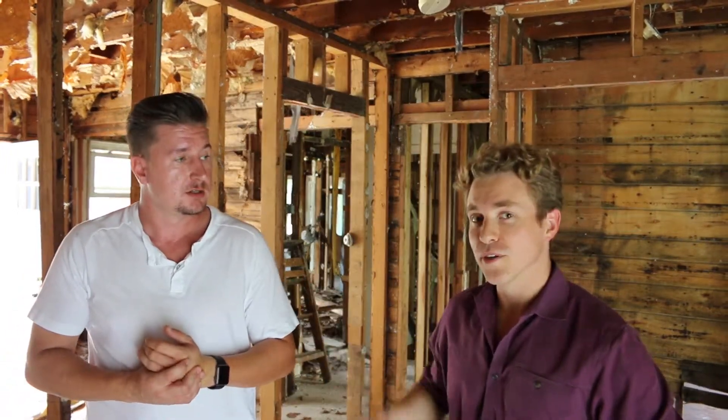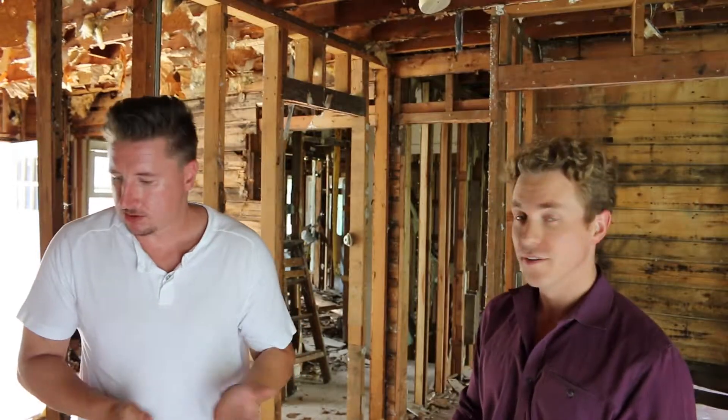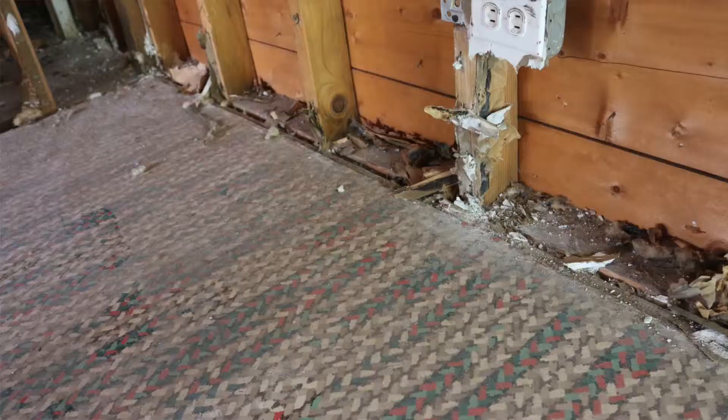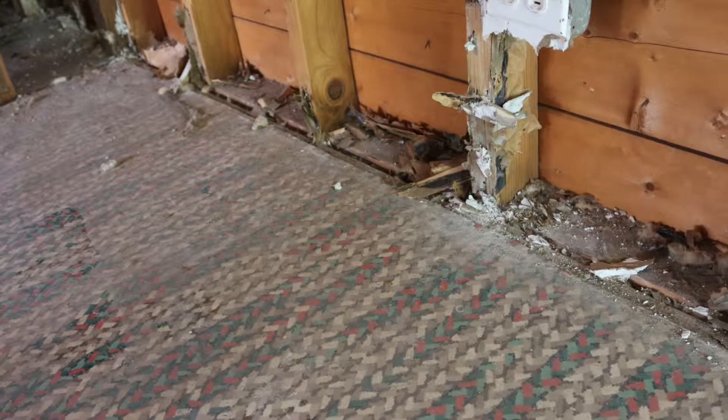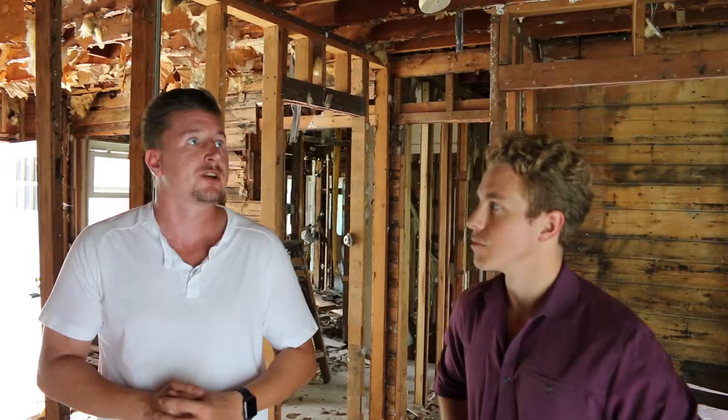As you can see in here, just to give you a feel of the existing — how they attached drywall before is with all these little drywall nails. That was the industry standard back in the day. Now, ceilings we glue and screw, and on the walls we just screw. You have more weight on the ceiling, so you want to make sure you don't have bowing and it starts to pull away. Something else Tim noticed is the bottom plate. Usually you just have a single 2x4 for your bottom plate, but look what happened here — it looks like they drywalled after they put the floor in. You can see the bottom plate is almost flush with the floor level, so when you go to attach your drywall you'll have nothing screwing in at the bottom, which reduces the structural integrity. We'll probably put in bridging to accommodate for that. Also, you need something to nail your trim to, so the bottom plate serves the purpose of not only anchoring the drywall but also attaching your trim. All your finishing touches.